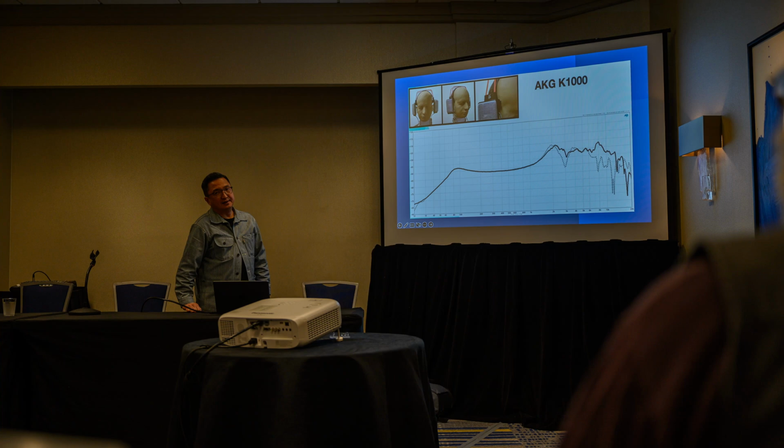You're measuring what it's like at any given position, with a 5128 or a 4620, wherever you put it in the ear. So now, of course, when you start going to something like this, it's going to help as well. Because again, you're not moving this far away from this area just in front of the drum that is the reference plane on a 711 that you're supposed to be measuring at. Again, with a 5128, you can measure from it anywhere. That would be technically out of the range, though, right? Because you're outside anyway. But at least you're better off because you have something that, yeah.